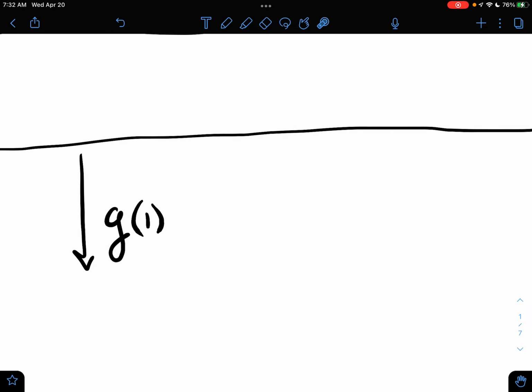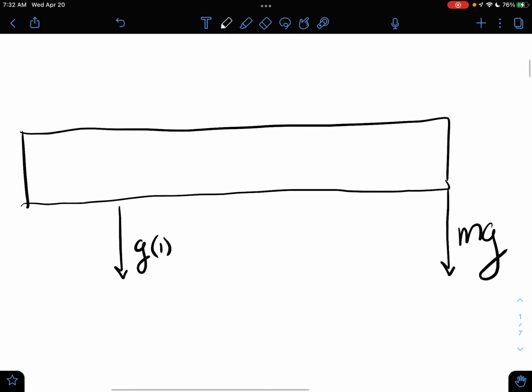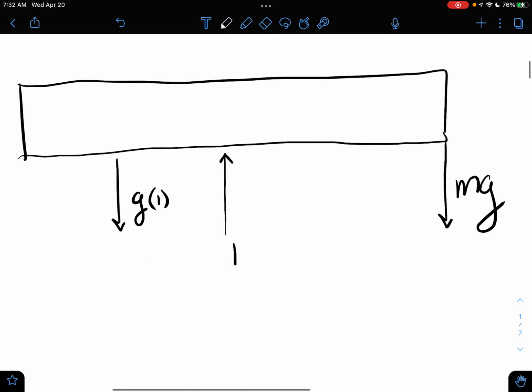But this isn't fully together just yet because we still have the support that's holding it up. Because if I'm drawing my force diagram, I draw a circle around the thing I'm drawing a diagram of, cut off anything that the circle intersects with, and make that a force. So we still have to find, in the center right there, some force from the pivot holding it up. Cool. Here's our force diagram.